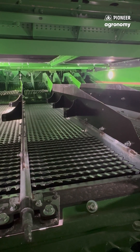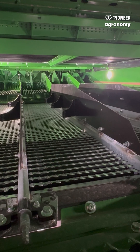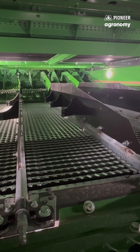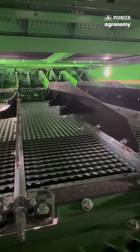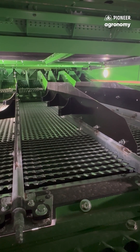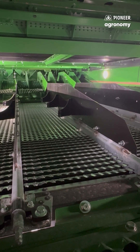The general purpose chaffer clearance is going to be 10 to 14, and then our sieve clearance is going to be 2 to 5. It is very important when setting the chaffer and sieve to make sure that they have been calibrated — they are calibrated to a 5 millimeter gap. I use a 5 millimeter allen wrench to calibrate my top and bottom screens.